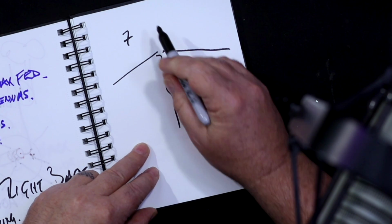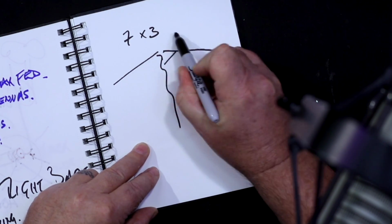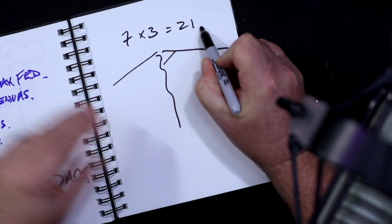He also told us that if you multiply that by 3, it's also going to be resonant on 21 megahertz. Now, there's something called end effect, which you can look up, and I've only recently come across it. It means if you've got exactly a resonant antenna at 7.1, it's not going to be next resonant at 21.3, times 3, because of the end effect, it'll be a little bit higher.